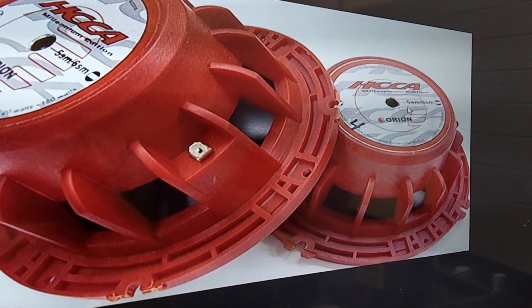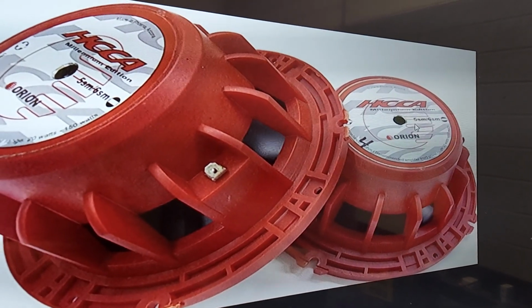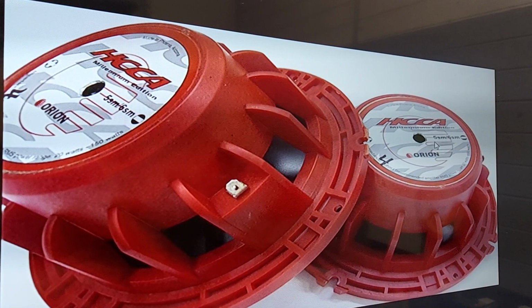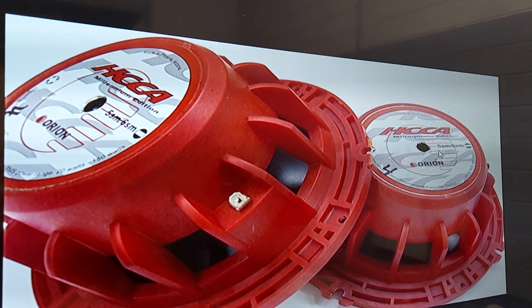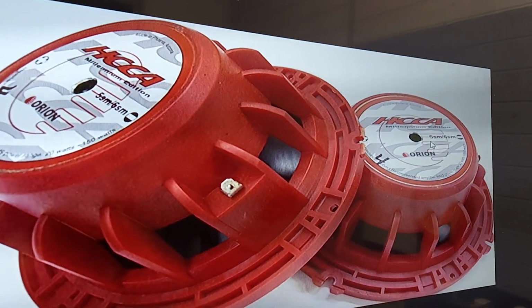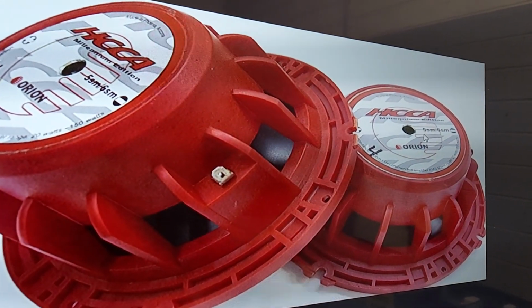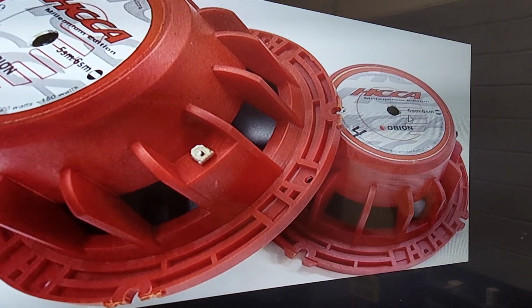But what we ended up doing was getting the magnetizer. I actually bought 2. I got 2 for $700, and then I had to get it refurbished because it came with a Mercury vapor switch, which is basically just a big vacuum tube worth of mercury. What you do is you would just move it, and it would connect the 2 electrodes to discharge the capacitor bank. I actually had that shipped all the way to the company, which I think is called Magnetic Instruments or something like that. They happen to still be in business. I don't think they're in business anymore. But I could afford to refurbish one. And the other one kind of worked, but then it ended up quitting.